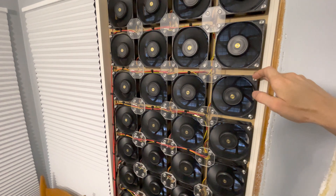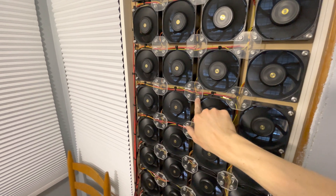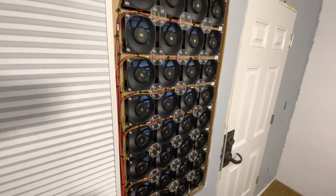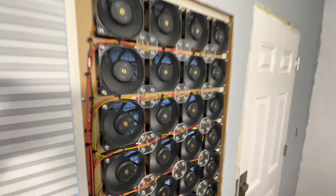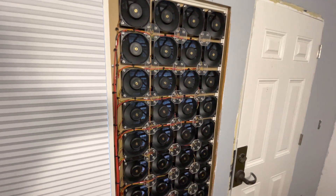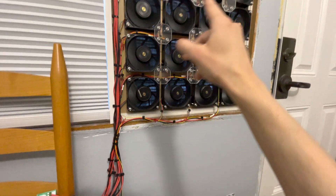I'll give you a little in-depth look. This is a quarter-inch thick acrylic plate, laser cut with the hole pattern to mount these. I have little reinforcement plates holding the bolts together with a little caulking, so it's pretty sturdy. Even when these fans are running full speed, it doesn't bow very much. This is actually replacing one of these sliding glass window panes — pulled out and tucked into the lip. There's a little air gap between there and the screen for the louver. It's held in entirely by friction, and this piece slides over so you can get behind it to service — remove a fan or clean the screen. These run four in a row and the power runs all down via a wire that snakes all the way up connecting all of them together.